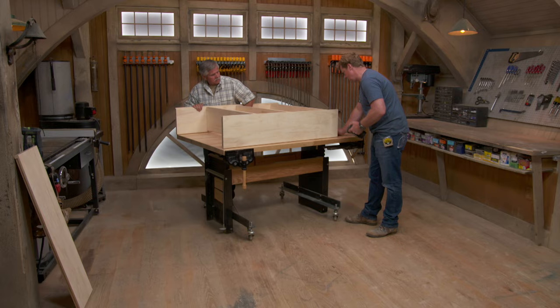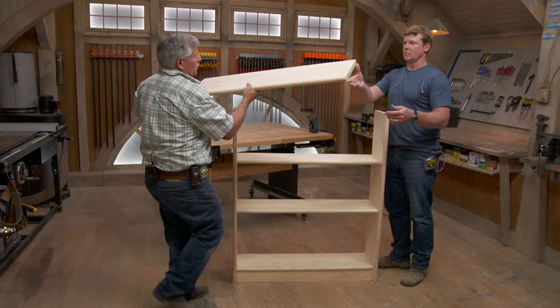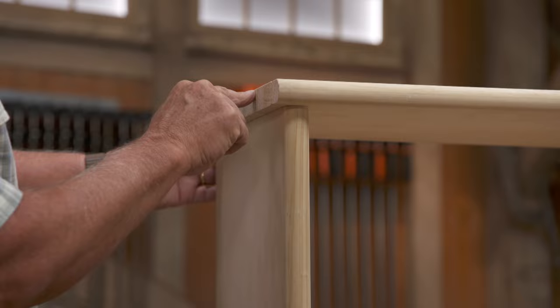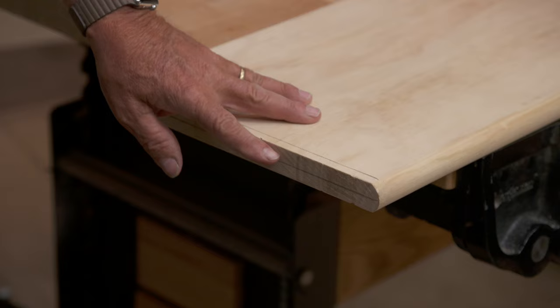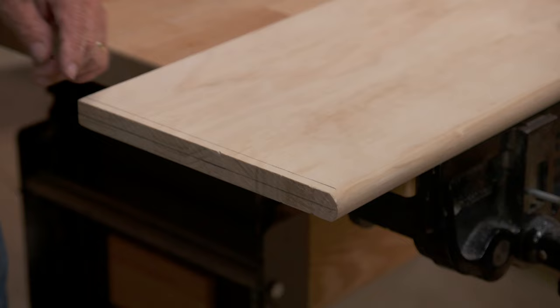Let's stand it up for a minute so you can see that our shelves are all on and our toe kick is in position. Yeah, looks good. Now the next thing is when I lay the top on top of the sides, I want to have an overhang on each end of about 3/4 of an inch. But what I don't like is this square edge on each side — it's kind of ugly. What we need to do is round that over to match the edges, and no router — we're going to do that with a hand plane. I've actually drawn two lines: one in the center of the tread to match the center of the nosing, and another line to match the distance from the front of the nosing back to the edge. I'm now going to take my plane and work my way down to the lines, curving it as I go.